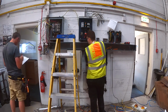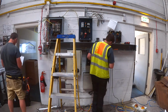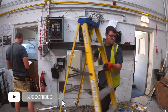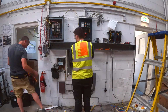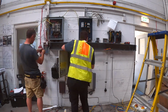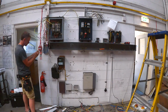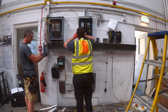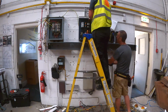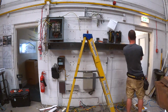There was also the three phase switch fuse that was between the two three phase boards. That was of an age where I think it had asbestos flash guards in it, so that's another thing that's not ideal. I can't remember what else. I think ultimately there comes a point in an installation's lifetime where repairing it isn't necessarily the best option, and just an upgrade and a change is needed, and I think that's the case with this job here.